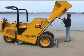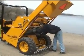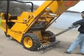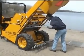Raise the hopper, pull the safety cylinder stops into position. Remove the retaining cap screw. Slide the screen up and out, and replace it with the coarse screen. It is a good policy to wear leather gloves when changing screens.